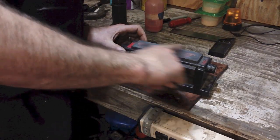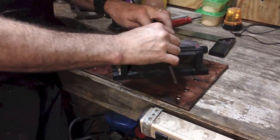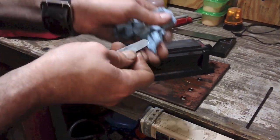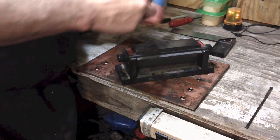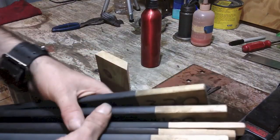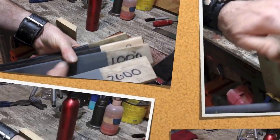What I've got here is a coarse stone — these are oil stones — and some honing oil. All we're worried about is just the tip. I've got the bottoms fairly flat. I've got sandpaper at 320, 400, 600, 800, 1000, and 2000. I'm going to go through each one.